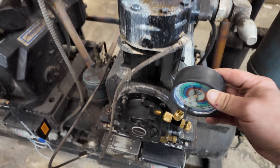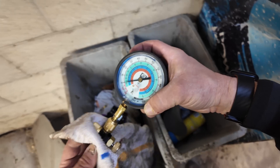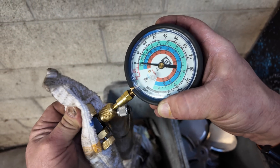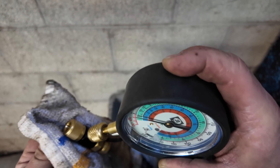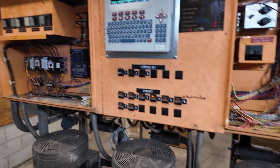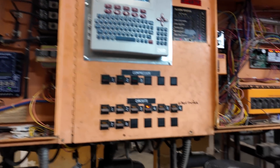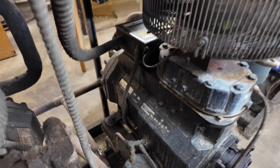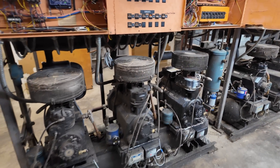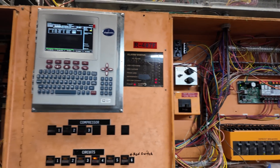Look at that — so no oil all over the place. It traps most of it in here. Take this over the trash can — makes it a lot easier to get your measurements and not make a big mess. It's been running nonstop now with no problems at all. Amperage, locked rotor — all that is fine. We've got our panel back in place. Everything for the most part looks pretty good on this one. We've got 20% rack level — I don't know what more you can ask for.